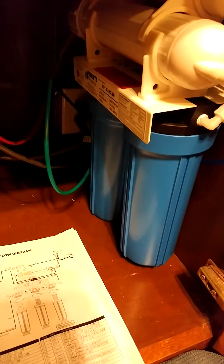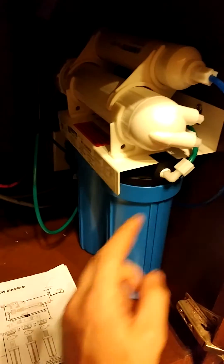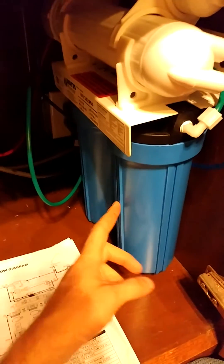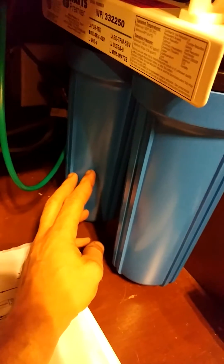We've been talking a lot about Abilene water and the condition it's in when it's coming out of the tap. We have this four-stage reverse osmosis system with two filters — one carbon and one sediment filter. This one back here has the sediment in it, and this is going to be the dirtiest because it's catching all the sediments coming out of the tap water in Abilene.